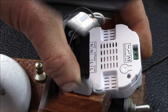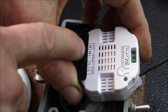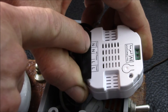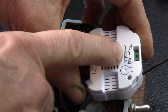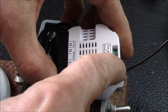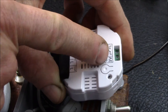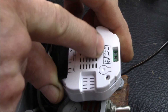Here's a close-up of the backside of the device. Here are the wiring connections — the center line and neutral connections are for AC power, and the outer connections are for your load. Over here you can wire up a switch; there's a 3-volt power connection you can use if you want to rig up a three-way type switch with multiple switches, running out to another switch and back.